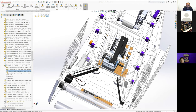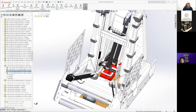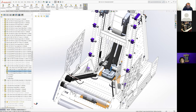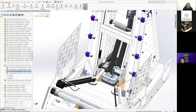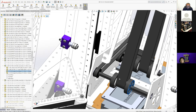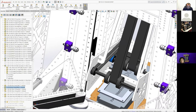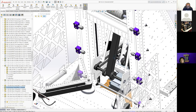One of our ideal design situations in the future is to have as few belts on shafts as we can get. If there's only one belt on a shaft, it's much easier. Even the ones powering here get a bit weird to install. They're not too bad because you just put the tops in last, but these are the powertrains for the tower, which we're going to go over in a second. Having to get both these belts in is a little tricky. If you just pull this roller, getting it remounted without taking the top one off can be tricky. There's enough flex in the Lexan that it works out.